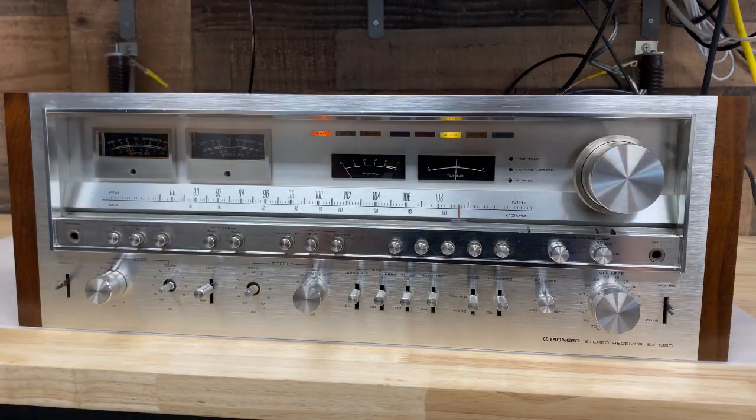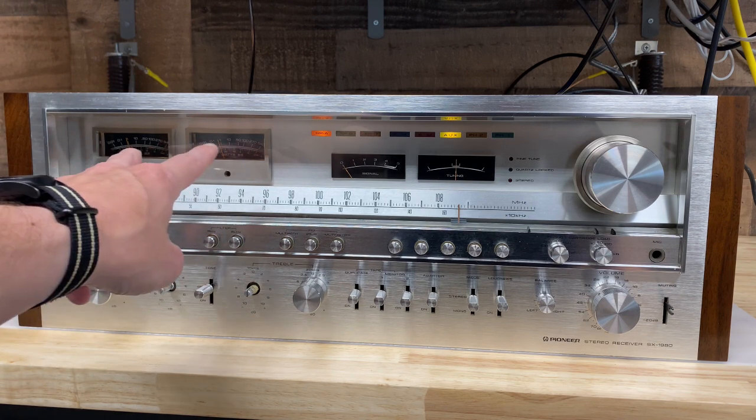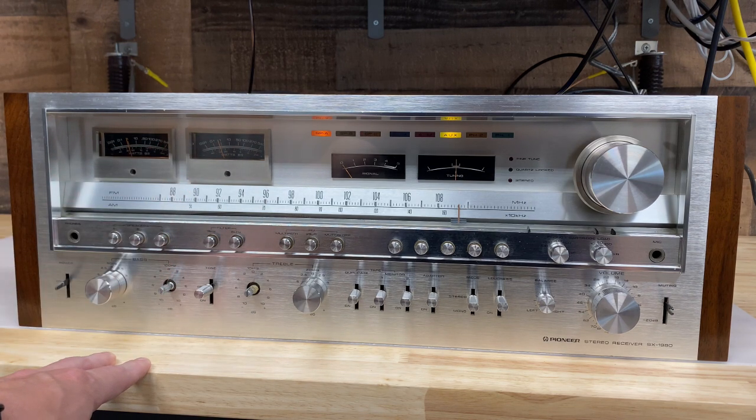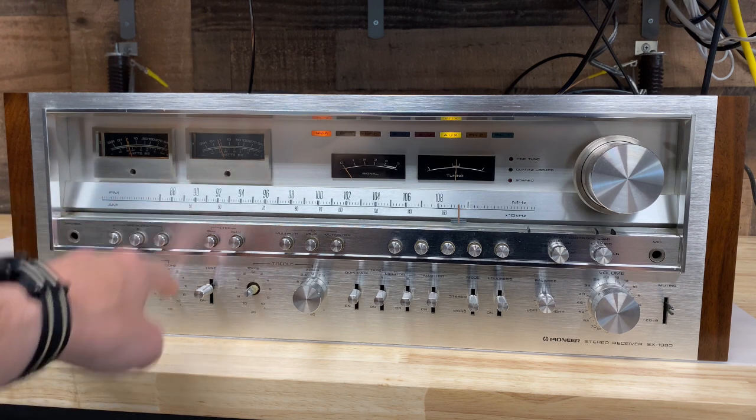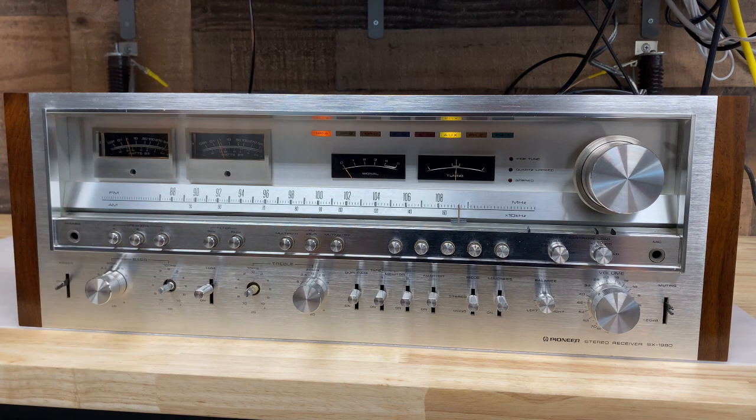So there's just a few issues that I see. They're very, very minor. You can see we do have a solid output from both power meters, but I don't think these are calibrated. I'm at about 15 volts peak to peak right now. You can't see it on the scope, but that's where we're at. And it's only showing about 1 watt, and that's certainly not 1 watt. So I think these just need to be calibrated. We'll do that in the next video.